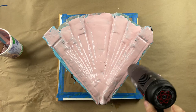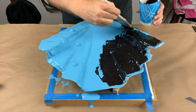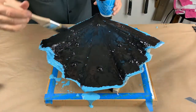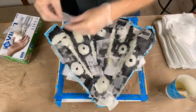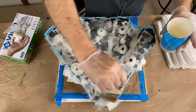Same drill as before — we start the shell on the inside with a coat of epoxy gel coat. This time I experimented and didn't put any release agent on the rubber to see if I could reduce the holidays. I was pretty confident the epoxy would play nice with the rubber, and as you can see we got many fewer holidays. Just as before, I smoothed out the shell with epoxy sculpt to make it smoother and stronger. It's just layer after layer of fiberglass — a lightweight cloth that conforms well to the surface and builds up nice and strong. Plenty to do next week: finish this mold and pour clear resin, which is always a shaky proposition. Hit the like button and I'll see you next week.